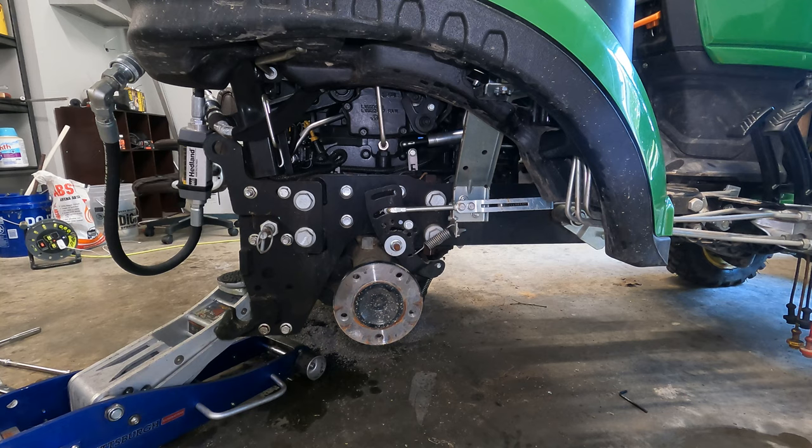What I'm going to do on mine is check it first, then turn it up — probably to 2100 PSI — just to get a little bit extra. And just to answer your question about the Hydrus Plus Performance Kit: everything that I've built is rated for at least 3000 PSI working pressure. Working pressure means that's what it can run at constantly. Burst pressure is typically about four times that, so you're talking over 12,000 PSI burst pressure. So as far as the kit I provide, it's rated up to that pressure.